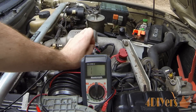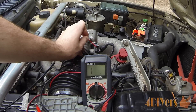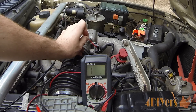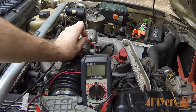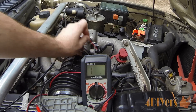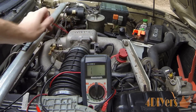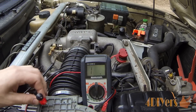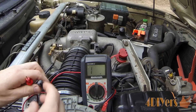The pinouts are numbered on the front side. Starting from the top you have pin 3, the middle is pin 18, and the bottom is pin 2. Pin 3 is for the wide open throttle position, pin 18 is the input signal, and pin 2 is used for idle. With the throttle plate fully closed, a resistance test should confirm the switch is functioning correctly and the circuit is closed.